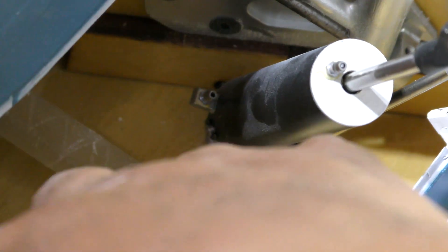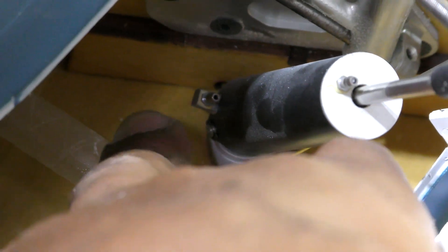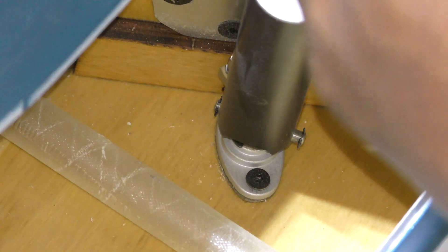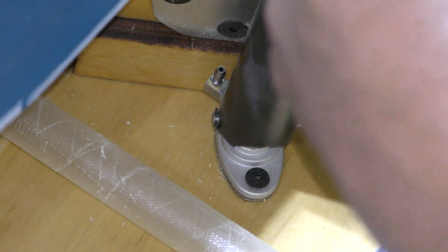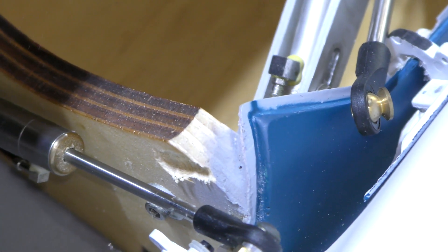The cylinder attaches to the bottom using two M3 size screws — one in the front and one hidden in the back. The thing to note is that this cylinder has one way it likes to sit: there's a side with a curve to it and the back side is pretty much straight, so that when the gear goes in the cylinder can articulate. When putting this back together I have to keep that in mind.